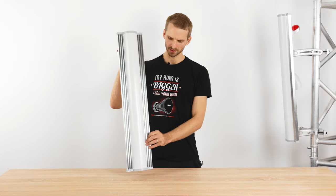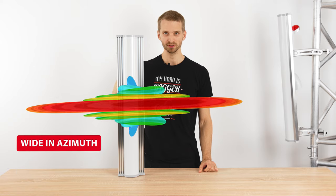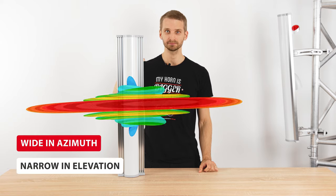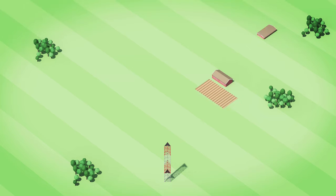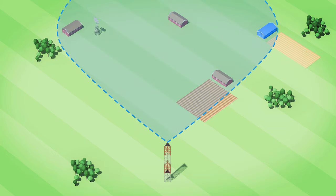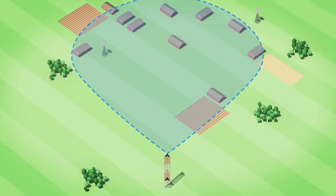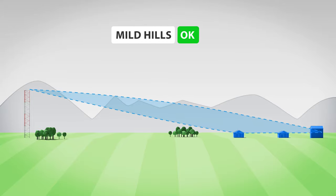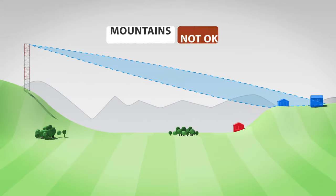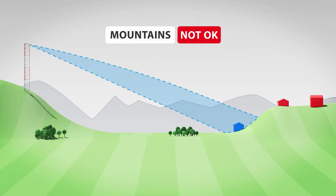Let's look at the RF features of the Array Sector. Its radiation pattern is wide in the azimuth and narrow in the elevation plane. This shape of radiation pattern is good for applications where the customers are spread throughout the coverage area. Thanks to the high gain, the distant customers in the rural areas are easy to reach. The landscape profile should be rather flat or mildly hilly. If you use them in hilly or mountainous regions, the elevation narrow beam will not cover the valleys well.